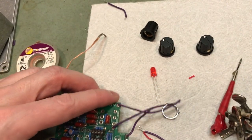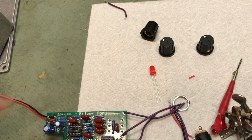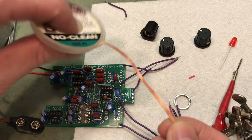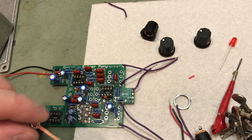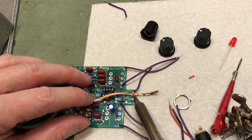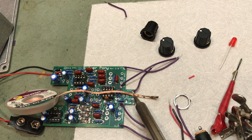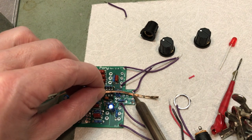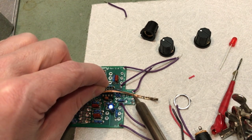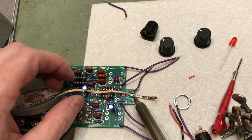This is just a little soldering tip. A couple of ways to desolder. This is solder braid. And its job is to just remove solder. So I'm going in very dry, and you can see nothing's really happening. It takes a while for the soldering iron to heat up through the braid, and then start wicking up through the braid. So this is a little counterintuitive, but add a little solder on top, and whoop, see that? Just comes right on through.